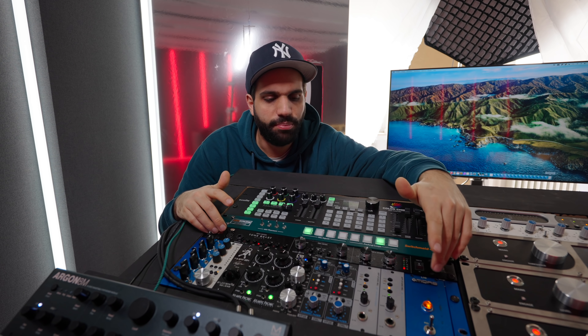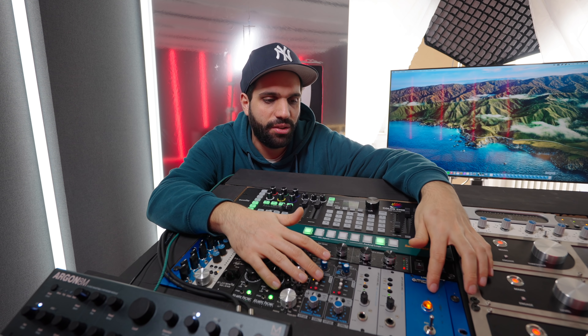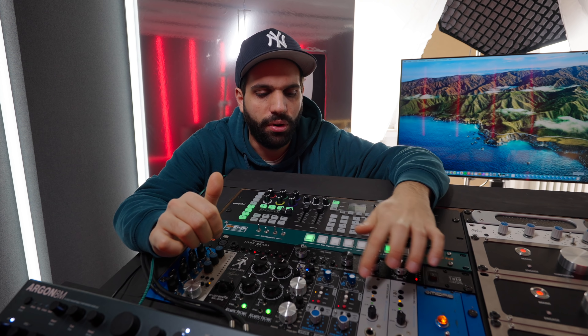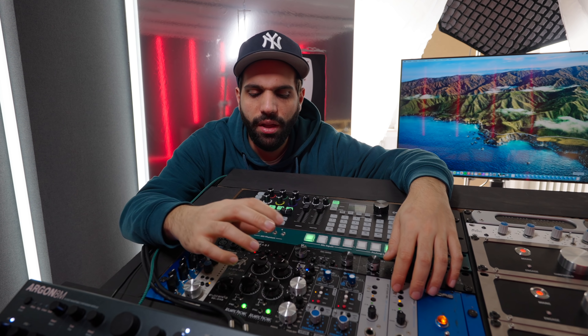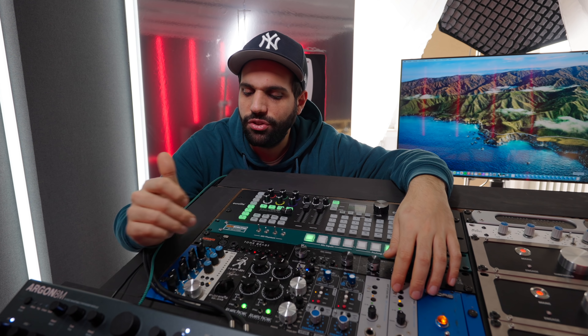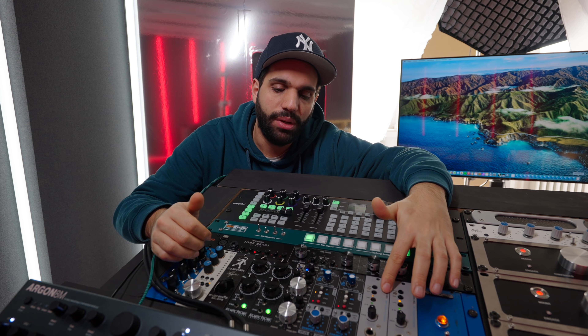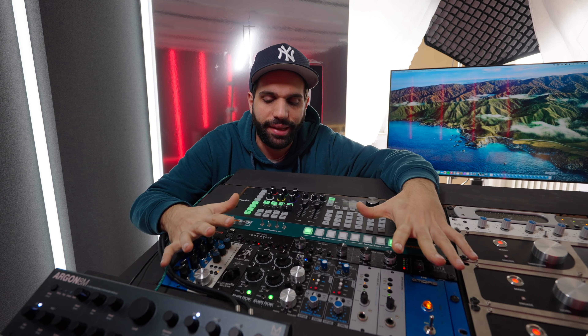Speaking of input source, I have the Warm Audio Tone Beast - I love it for guitars, you can also record vocals with it. It's a preamp, same as everything below it. That's the Midas 500 series - a very cheap 500 series unit. These four are preamps - not original preamps, these are clones, but they sound very similar. Then we have a mastering EQ for shaping, a reverb that isn't even plugged in, and then a compressor and EQ. This stuff is chained into each other through the preamp loops, so I can have a vocal go through an EQ and a preamp, or just a preamp. That's why I have these twice - I can select if I want to compress on the way in or not. It's very flexible.